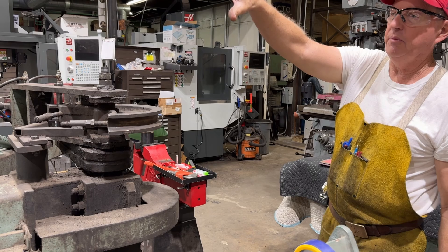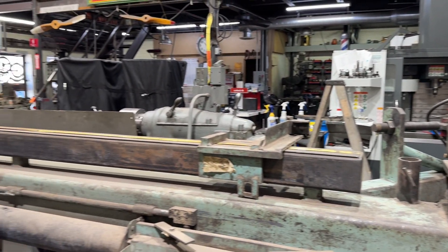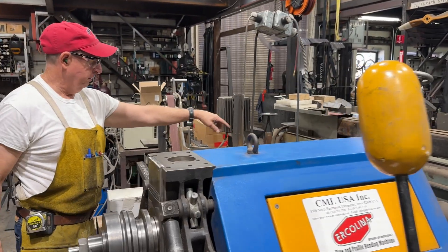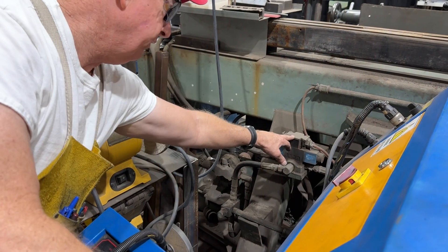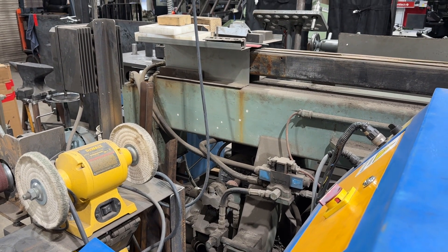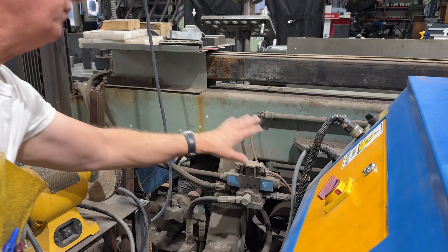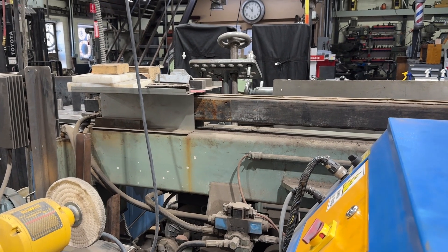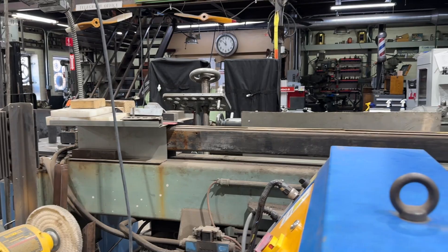The hydraulic system is at the back. There's a five horsepower single phase motor driving what I think is a gear pump. Here's the control valve right here. And at the back is the fill tank for the main hydraulic reservoir. We've got a ton of fluid in there — it never would overheat. I think we've got about 20 or 30 gallons of hydraulic fluid in that thing, maybe even more.